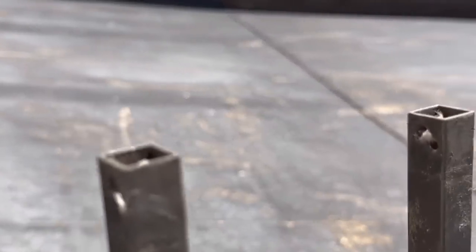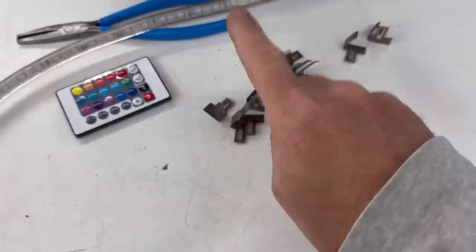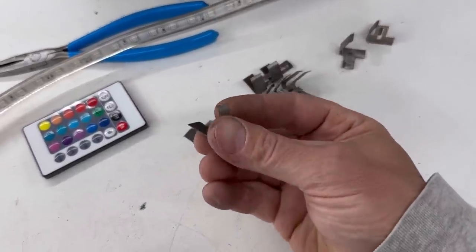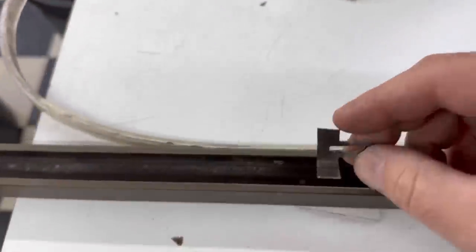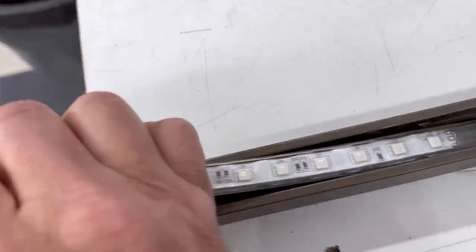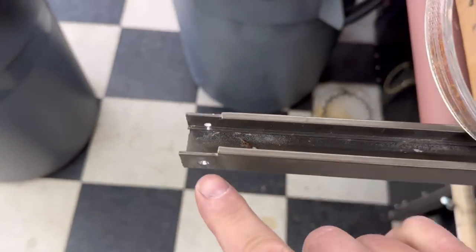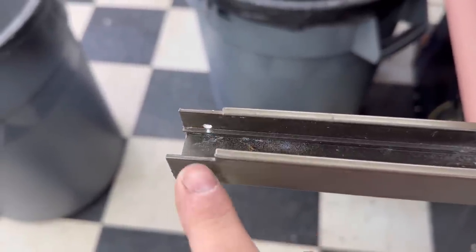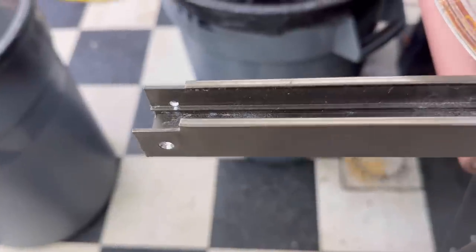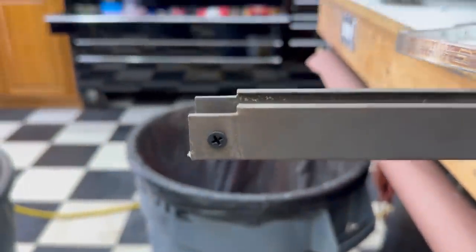What I've done is removed all the clips off the ends that held that top rail on. Here are all the clips from just that one section of railing — they hold this top rail on at every point of the upright spindle. I just have to cut a very little bit of the tip off of one side, and now they re-snap in as if they were hooked into the rail. I'm going to put this rope lighting down in the channel like that, put these clips in, snap them in, and that's what will hold the rope lighting in. I've got some holes drilled through these channels — originally one hole that went into the post — but I've got to drill a second hole and then countersink each hole.